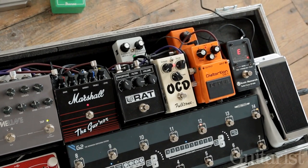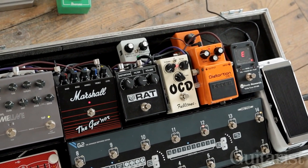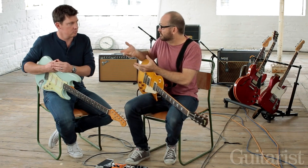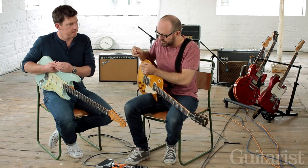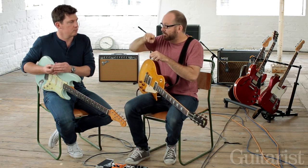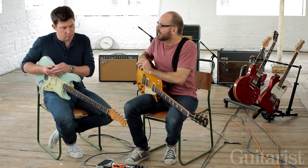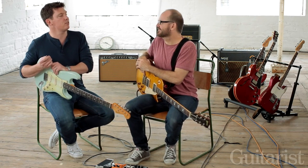We were just discussing before we hit the record button one of the most important questions, which is: what's the difference between overdrive and distortion? And this is not a joke. The main difference is the harmonic content. If you look at an overdrive pedal, the way it puts the note into distortion — because it's still distortion — it has a lot of even order harmonics, so it sounds very warm and lovely. With distortion pedals you get more odd order harmonics in there as well, and it just sounds angrier. The way that the top of the waveform is cut off is a lot sharper, and it sounds a lot more aggressive. It's the same concept — just more and angrier.